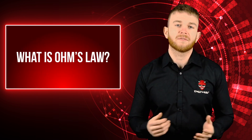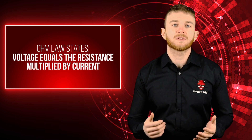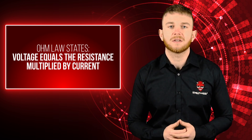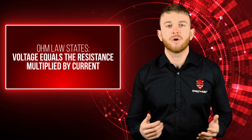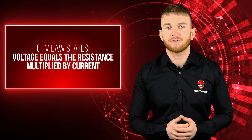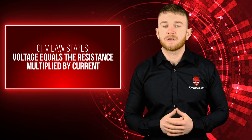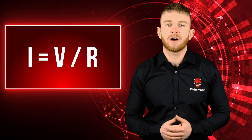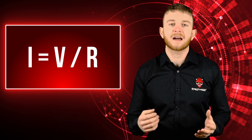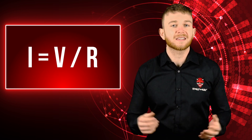So what actually is Ohm's Law? The formula is V = R × I, meaning voltage equals resistance times amperage. Ohm's Law states that voltage equals resistance multiplied by current, and is a formula used within electronics and physics to determine current, voltage, power, or resistance in a circuit — in our world, the e-cig is the circuit. An atomizer head's resistance is only a factor concerning battery life when using a direct current, bypass, or mechanical mod kit. To calculate the current drawn from the battery if using an unregulated bypass or mechanical mod, divide the voltage by the resistance of the atomizer head fitted using the formula I = V ÷ R. The higher the current drawn, the faster the battery will discharge.